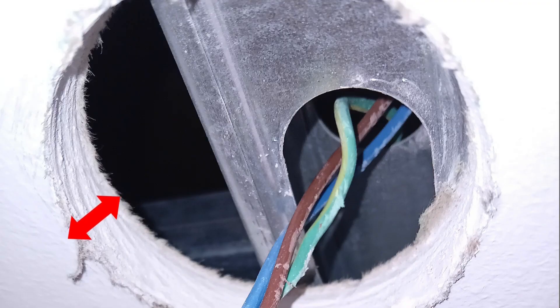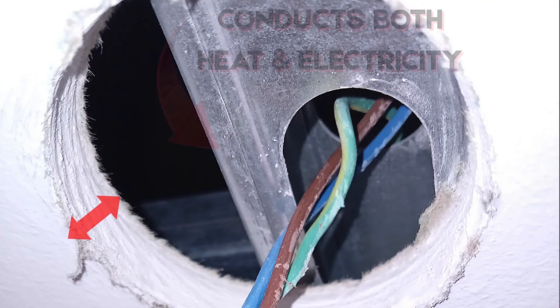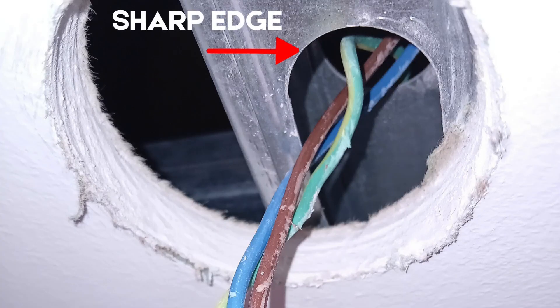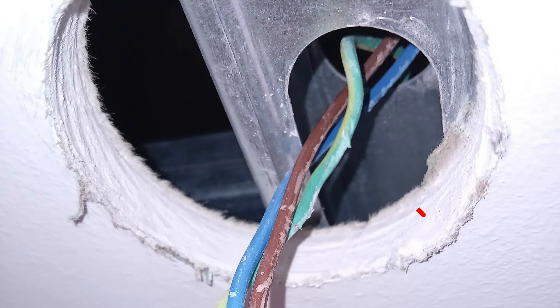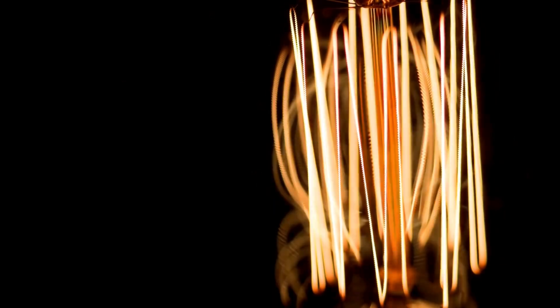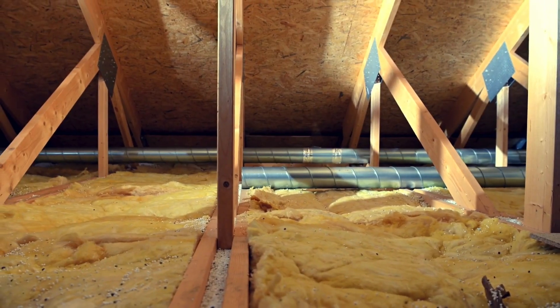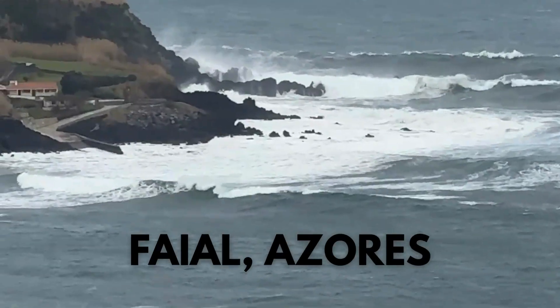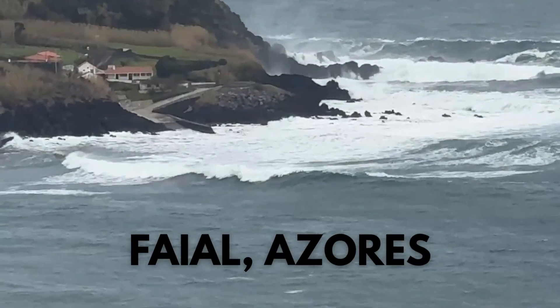In this scenario, you may think the wafer-thin LED could fit in this space, but with the uncertainty of heat clearance and the fact that it is a metal stud conducive to both electricity and heat, I decided to move the mounting location for the standard LEDs that were already on hand. To make matters worse, one set of wires had been pulled through a sharp cutout in the metal stud without conduit. The razor-sharp edge of the cutout can eventually grind through the wire insulation with just natural vibration, let alone additional factors such as movement from the wind, frequent air drafts within the crawl space, the occasional island tremors, and even heavy Atlantic waves crashing along the coastline that are sometimes enough to rattle objects on shelves.